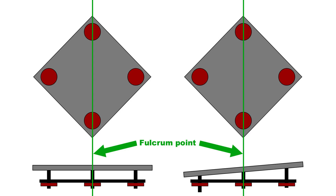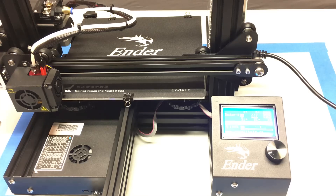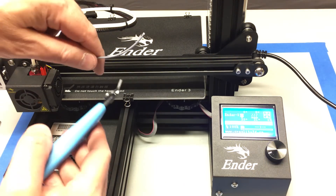What you want to do is once you've done the paper test in all five points, go back to your first point and do it a second time. That's just to make sure none of your corners have shifted more than you want them to. The first time going around with paper is just to get it in the ballpark; the second time is to get it really zeroed in perfectly. So remember to do that twice.